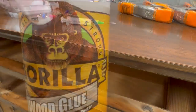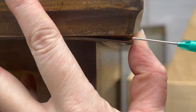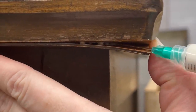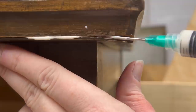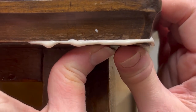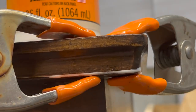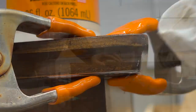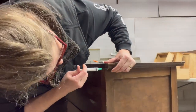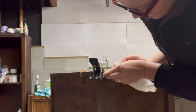Okay, what is this scariness? Well, this is a crafting syringe, which is super helpful for fixes like the one I had just discovered I needed to do. A very common repair for an old piece like this is that lower trim or veneer that has come loose from the top, usually in the corner. Using this craft syringe, you can get your wood glue way up and into the back of that little space. I clamped that corner and wiped up the glue, and then of course found another corner that needed the same fix. This is kind of the rule with antiques — there's always another spot that needs the same repair.